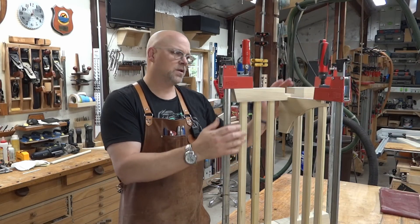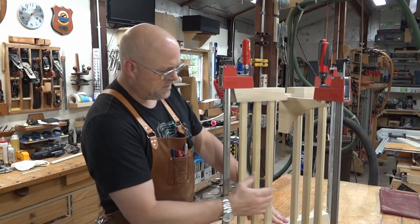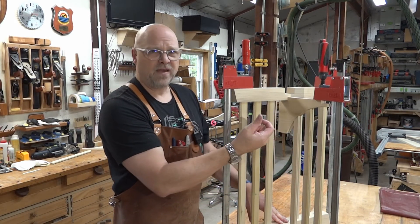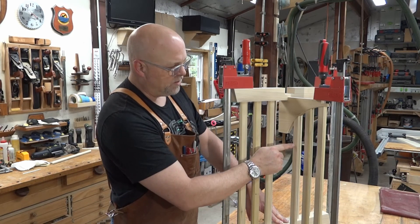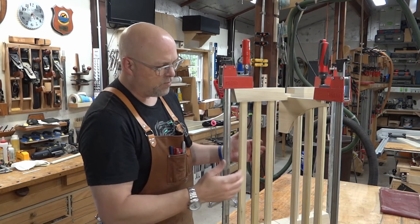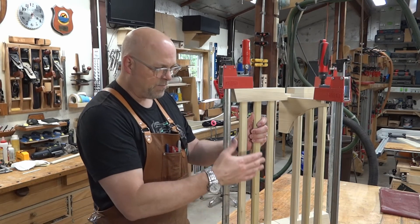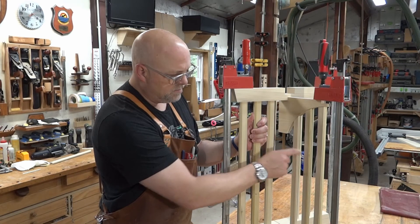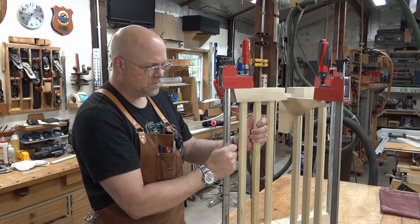Through the magic of television, I've got this piece and the other one glued up. What I did not show you is that it's glued and screwed back together. I beveled these pieces 45 degrees and these three are thinned out down to 5/8ths of an inch so there's a slight reveal — this is a three-quarter inch piece and I didn't want them to be flush. I had to remake one of these pieces — it was about an eighth of an inch short. The curve met fine so I'm not sure what happened, but I remade that piece. Luckily I left my domino set up so I didn't have to redo that — I just ripped it down, put the domino in, thinned it up, and cut the curve.